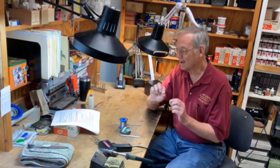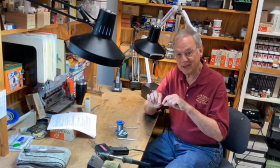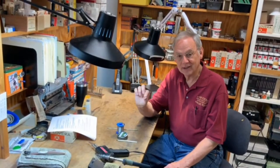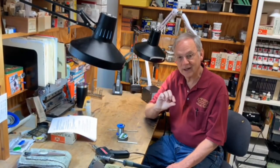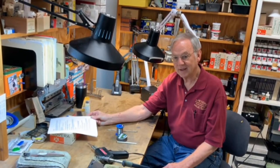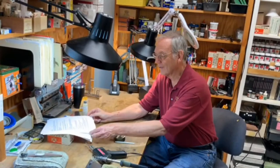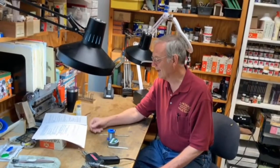How do you solder? Soldering is actually done by heating the work — the piece that you're going to solder — and letting the solder melt by touching the piece. What this creates is a superficial mixture of atoms. The tin in the solder and the copper in the work will actually form a small ionically bonded mixture on the surface. That's what makes it a strong bond. If you melt the solder before you heat the work, the solder will ball up and you'll get what's called a cold joint.